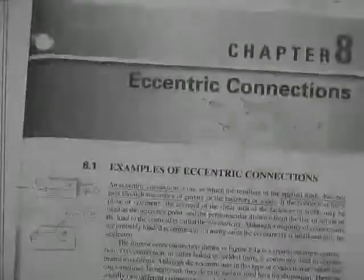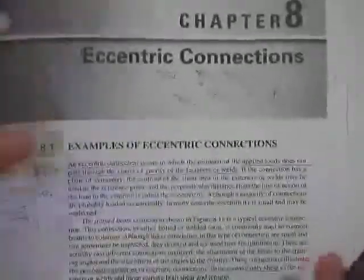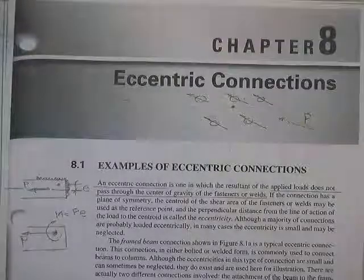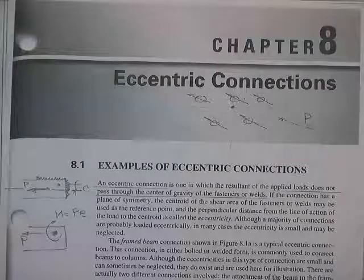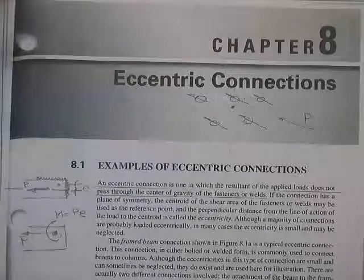Load stress design. If the welds were a higher strength, you would pay a little more for the higher strength rod. You have to make sure you keep track of who's got one and where they're at, and make sure they're putting them on the right connection. Probably the guy's going to say, look, unless you're going to use those different rods on the third floor and above, I don't want them just over in the ballroom and over in the so-and-so, because I don't know that my guys will be that careful.